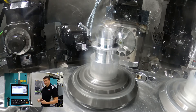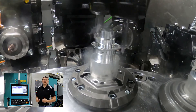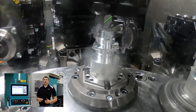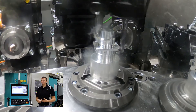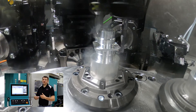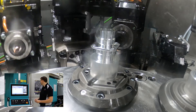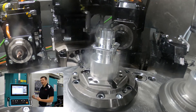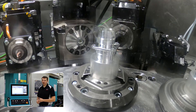In our next position we're going to use an X and C axis transmit with one of our live tool stations to create some flats. We can mill any type of contour with this as long as the tool can come in from the face of the part. Then we come in with a drill and drill out the front flange of this part.